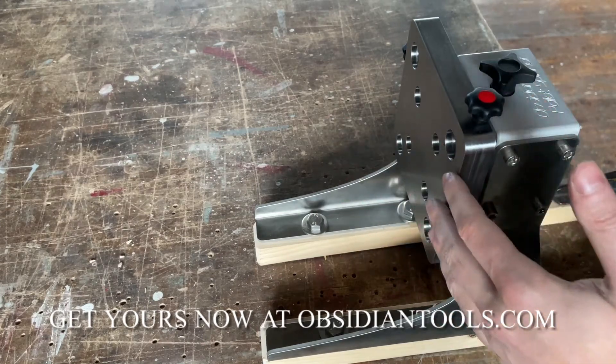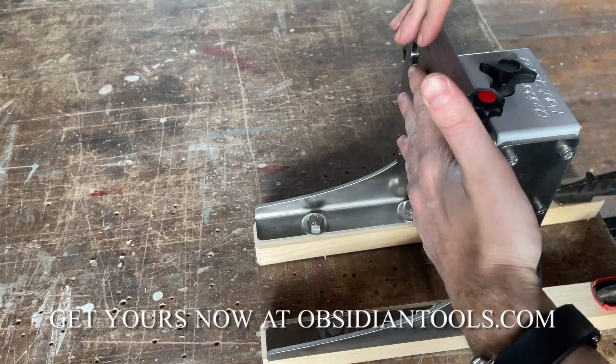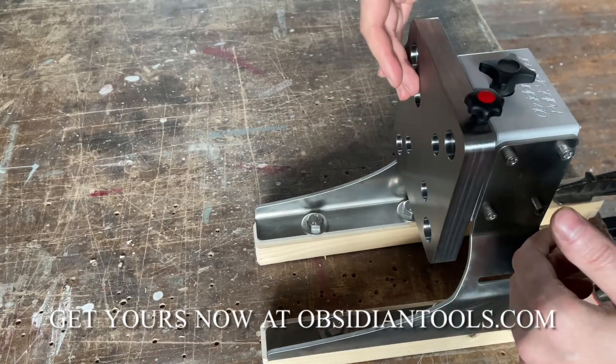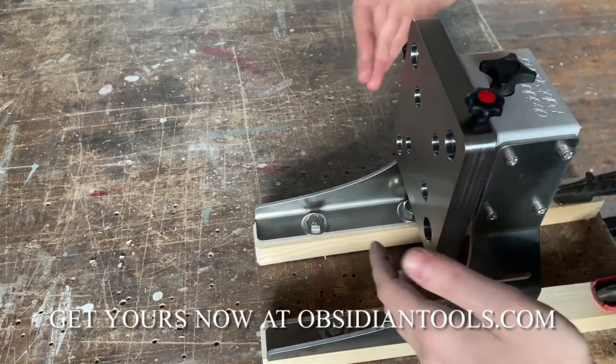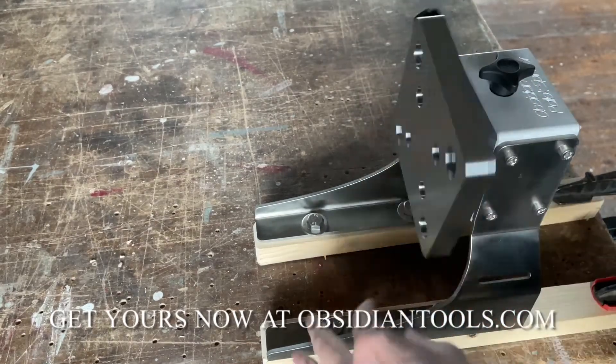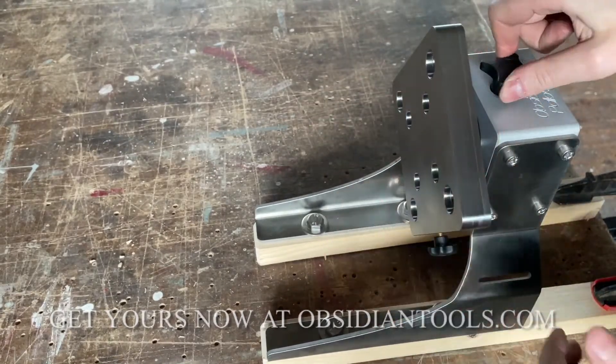With this device you're able to mount your tombstone on the faceplate here — both the smaller 52mm pallets and the bigger 96mm pallets — clamp it, and then rotate your tombstone however you like in an ergonomic way.